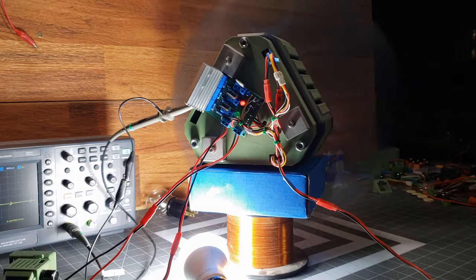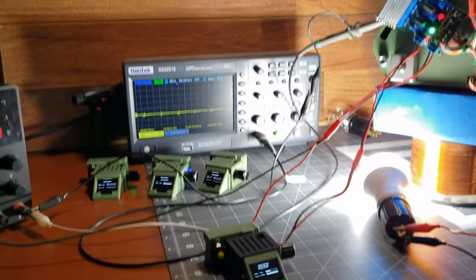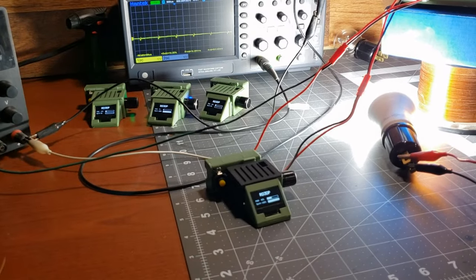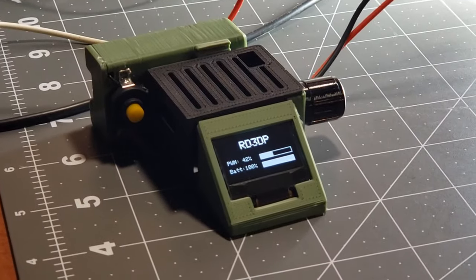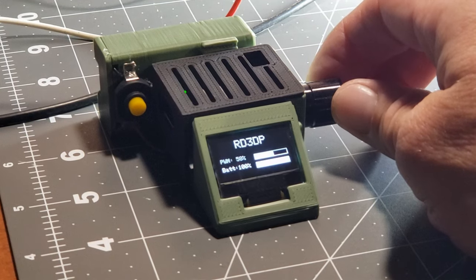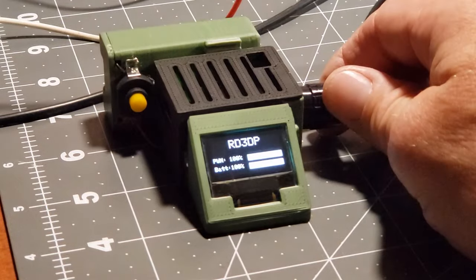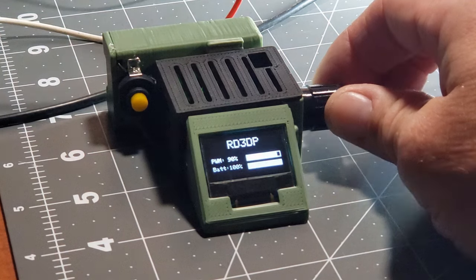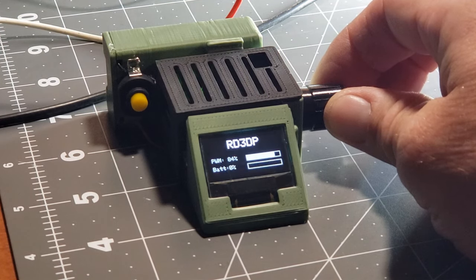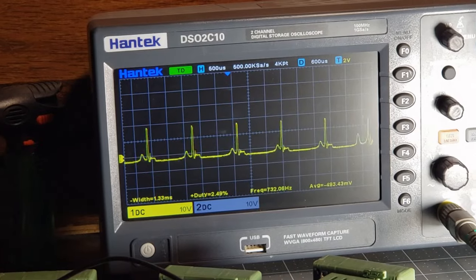The optical timing disk is adept at driving the motor on its own. However, the incorporation of PWM further chops up the signal, creating motor flyback spikes every time any of the three coils turn off. These spikes occur due to the sudden collapse of the magnetic field around the motor's coils when the current is abruptly interrupted by the PWM. The collapsing magnetic field induces a voltage known as the flyback voltage, which can be harnessed to power a load. In this demonstration, we channel the flyback voltage to illuminate a 120V light bulb, exhibiting a practical utilization where the generated energy is effectively repurposed.